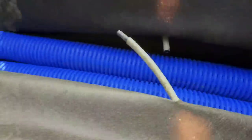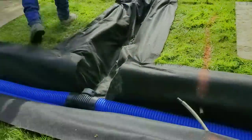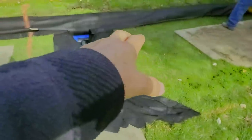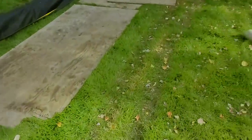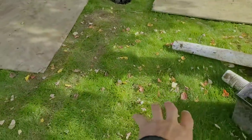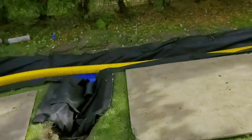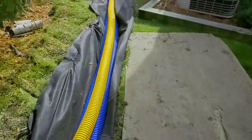Those inlets are crazy large, so the water just moves right through the pipe. We're going to do a French drain grid — this yard is flat and really saturated all through here, really soft. We want to get this completely done before we start working over here, because we're just going to take our plywood, move it there, and repeat.